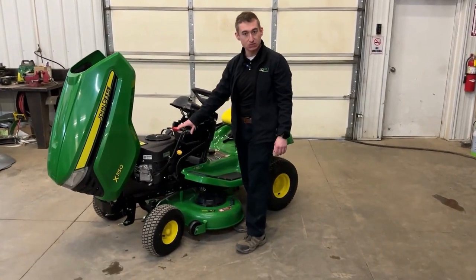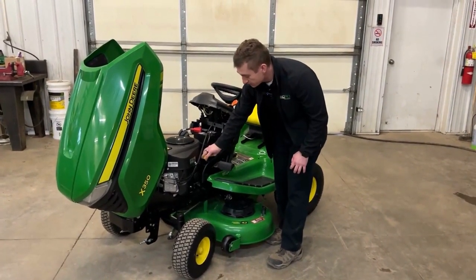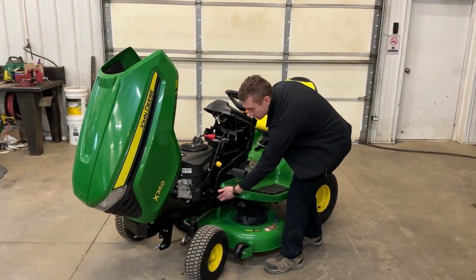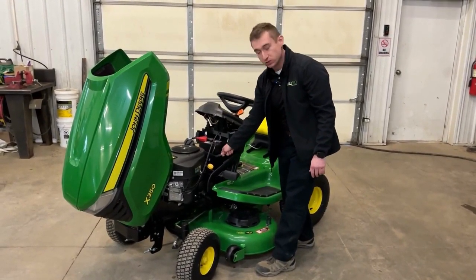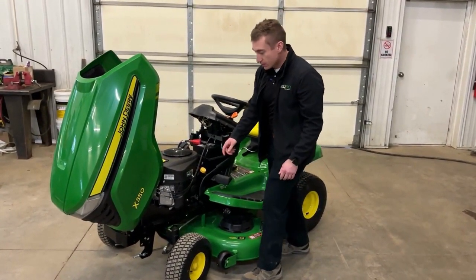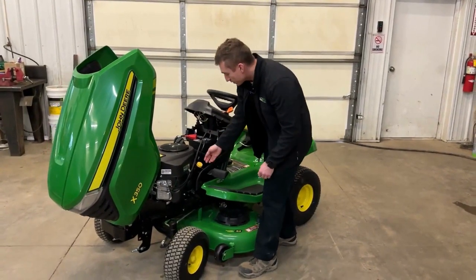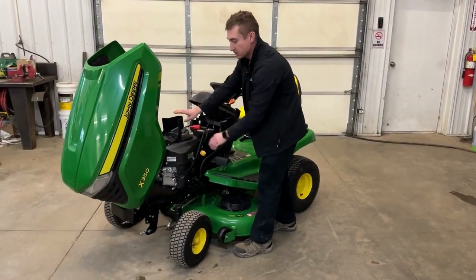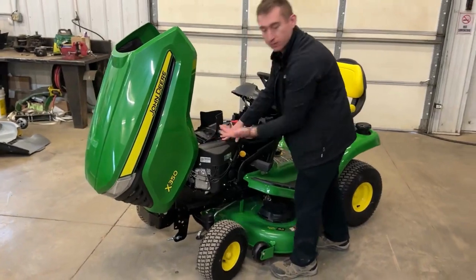The maintenance inside here is extremely easy. Everything for an oil change is on the same side — you're going to have your dipstick right here as well as the oil insert, and next to it is the oil filter and the drain plug. So everything is on one side and very easy to get to. The battery is tucked in with a really nice durable strap, easy to take off and put back on. There are two spark plugs — one on each side. The fuel filter is very easy to get to right next to the battery, and your air filter comes in a nice easy clip-on case with a clamp to remove it.